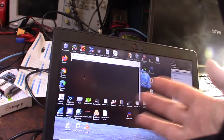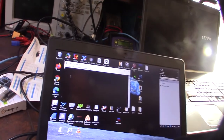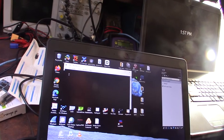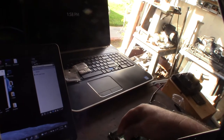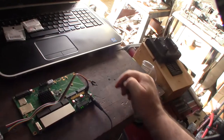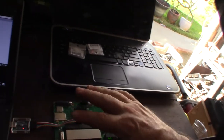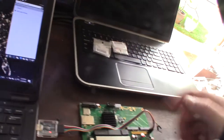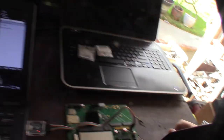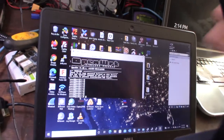Baud rate is the communication speed between the device and the terminal, and also how fast you can transfer files. With a Cisco router the default is 9600 baud. Looks like the console is ready — I'm going to plug in the router and fire it up. I got it to work. The transmit and receive pairs are reversed, so the transmit pin goes to the receive pin and vice versa. That's the Linux console — it's like having a monitor, keyboard, and mouse connected to it.